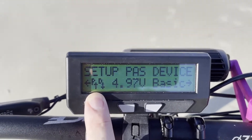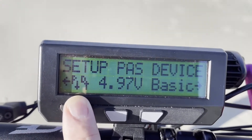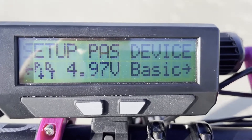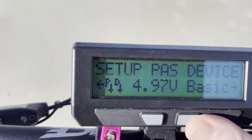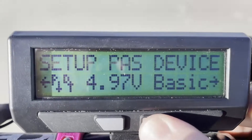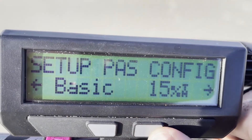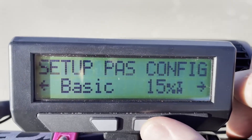You wire the PAS sensor in and it takes the signal — you can see the pedals moving here, though they're moving backwards so it doesn't register, but when moving forward it picks up. This takes the PAS signal and outputs it as a throttle signal, converting PAS input to a basic throttle signal and allowing it to work with any controller that has a throttle line. That's fully tunable — you can set the power level, power assist, how many poles the sensor has, etc. I have this set up where it delivers 15% of the total power on the bike, with the ability to cycle through that. There are many custom tuning features for PAS.